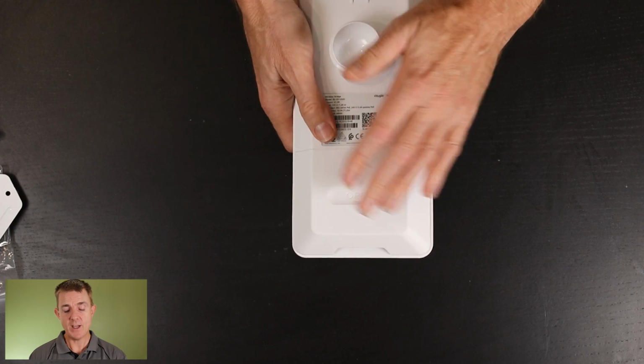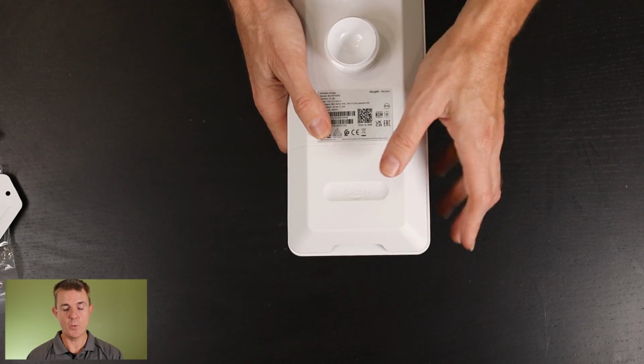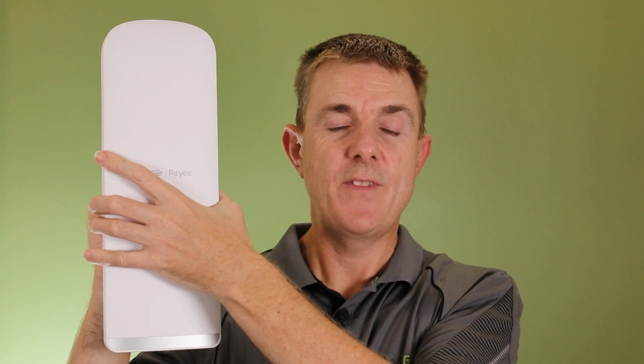Then we've got this, and everybody asks me, is this okay, especially for the Australian environment, is it watertight? Let me bring this back out to the camera again. Every time we do this, can I suggest we talk about this? The cable comes a long way inside this, and yes, this is fine for full outside weather conditions, but we want to stop water getting back into here. So if we're going to have an Ethernet cable, we don't want it to be flat, we don't want it to be going downhill, and we don't really want it to be going uphill like this, because water will actually travel in capillary action back up.